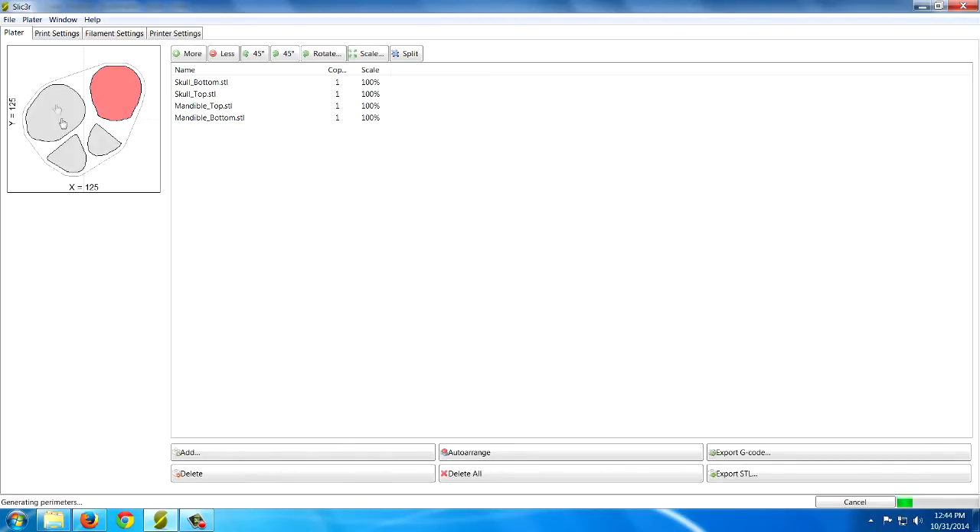You can see how you can organize the parts — this is probably a top-down view, and there's a circle around the whole thing that shows the area you'll need on your 3D printer. You can flip parts, rotate them, and turn them so it makes sense, because it's better to start with a flat surface to the glass and then build up the crazy shapes. That comes with experience using the machine, which I have very little of.